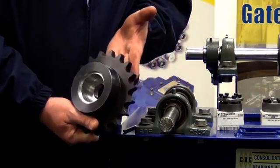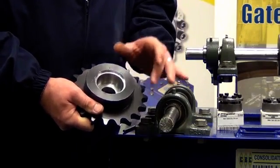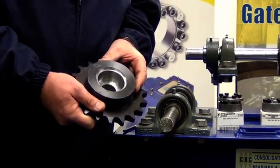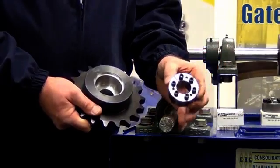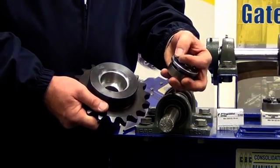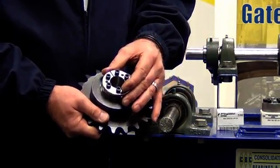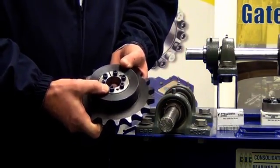Now we're going to show you the typical installation of a Mavlock into a hub. In this case we're using a sprocket. That sprocket we have pre-machined to a tolerance which needs to be specified. In this case that tolerance is an H8 fit into the housing or into the hub. We take the 1061 unit. We need to have those bolts nice and relaxed, so we make sure they're relatively undone. The unit will slide relatively easily with some clearance into the actual sprocket itself.